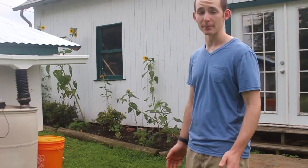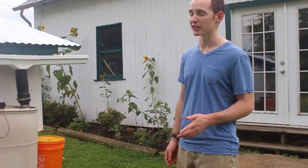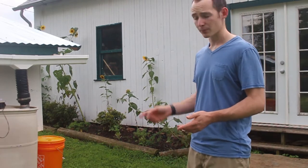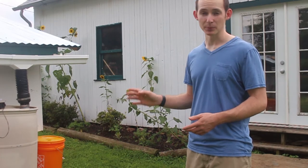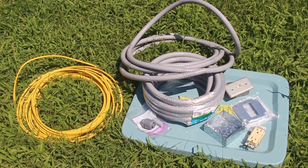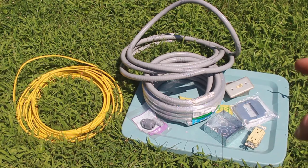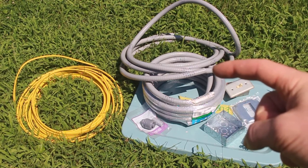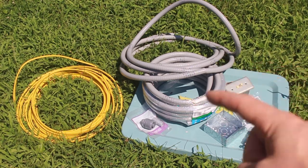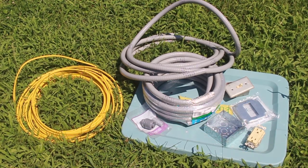The first step, and probably the hardest step, is going to be to run power from my shop out here to the chicken coop. I originally thought about doing a solar setup with a car battery, but that was just extra expense I didn't really want. Brendan was able to make this and ship it to me for $80, which is approximately a third of what I would have spent on a commercial unit. Here are the materials I think I'm going to need for the electric install: a leftover GFCI outlet from our bathroom remodel, a cover plate and box, a switch for the inside so we can turn the power on and off, some soft conduit rated for direct burial, a coupler for the conduit, an entry gland into the box, and 12-2 Romex left over from another job.